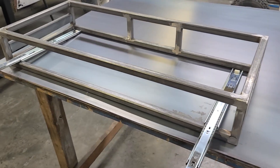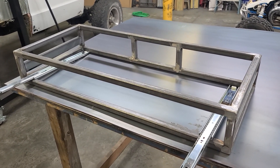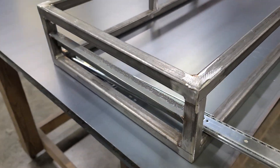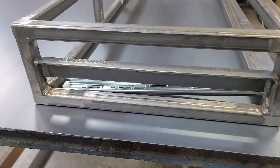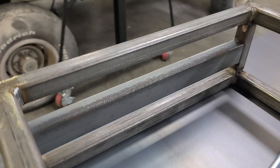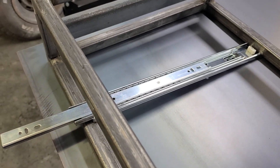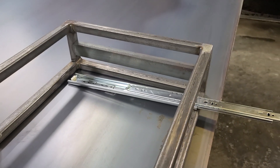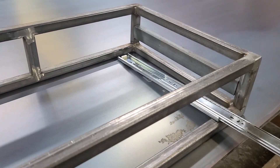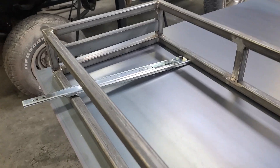Basically this was one of the projects for today. I made a framework out of one-inch box tube, 11 gauge — that's going to be the framework between the top and bottom box. Then I had inch-and-a-half angle iron which I thinned out one side down to one inch, giving me an inch-and-a-half flat on the inside. I picked up some roller slides, one for each side — they were about $12 at Lowe's.